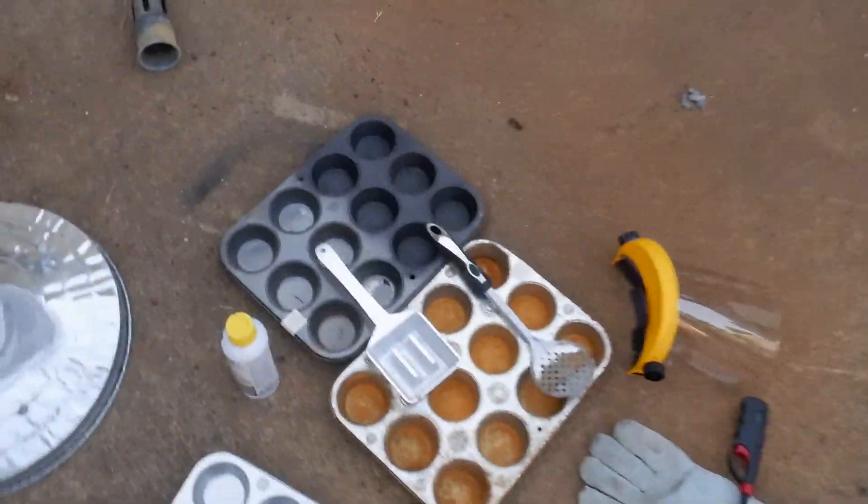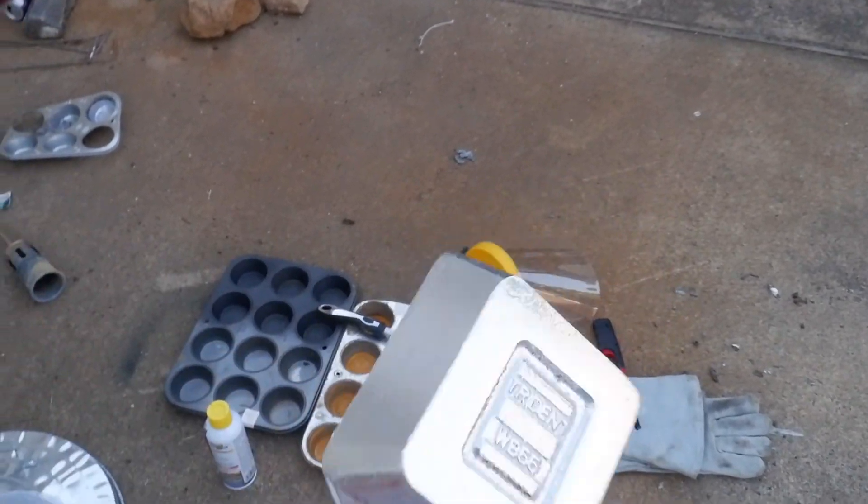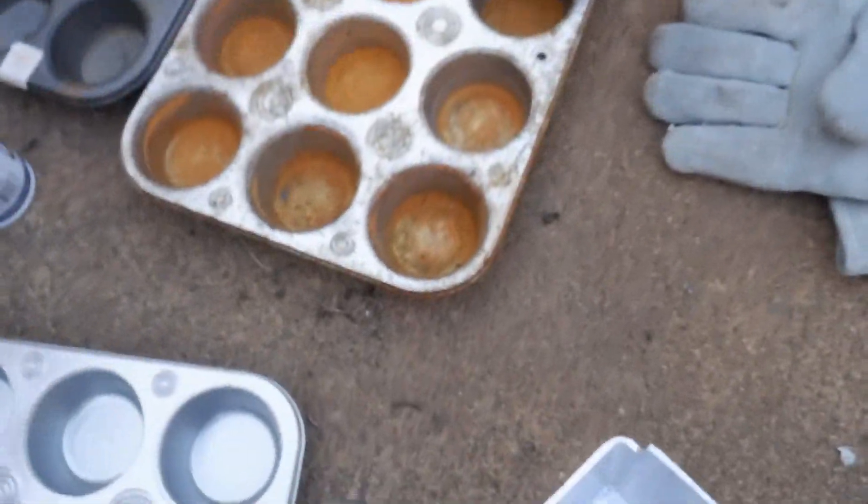I've got another little surprise too. We're going to try to use this mold right here to make some diving weights. You pour it in and it makes holes where you put the strap through for diving weights. We're going to set it on top here and let it heat up. One other thing - last time I had a hard time getting the lead to come out of my molds. I did buy some other ones from the store, but one thing we didn't have is any mold release. Someone on the internet said take a candle and let it smoke the inside - that carbon would help release. So I looked up mold release stuff and they use graphite, which is another form of carbon in crystalline form. I found some graphite spray at Home Depot - I'm thinking this would be really good for releasing anything you pour into a mold.